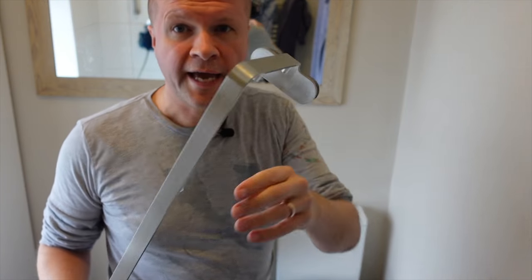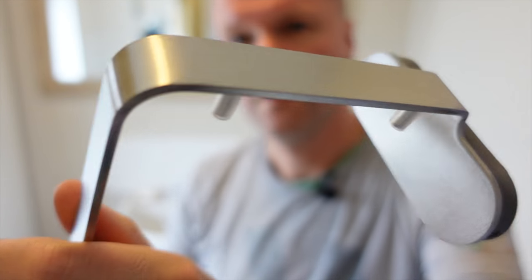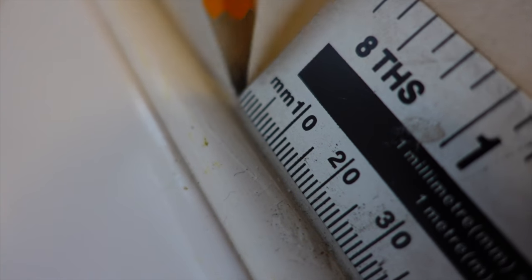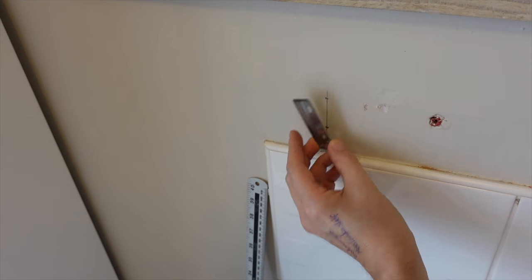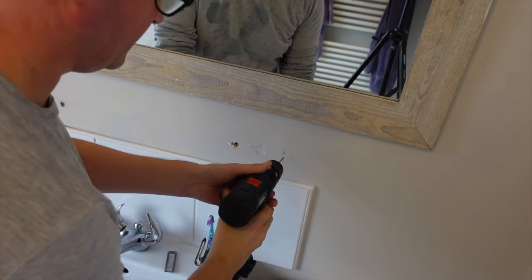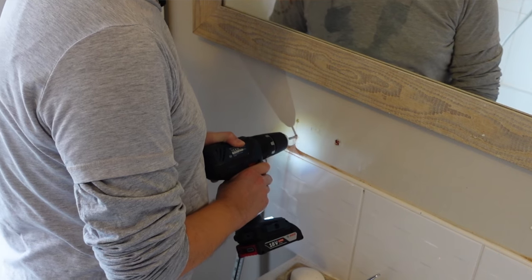Be careful because there is glass in this — it comes wrapped. You get a metal bar thing that holds the glass shelf. I'll show you some of the detail here — look at that! This feels really solid, much better obviously than my $5 picture shelf. So if I measure and find the midpoint... half of 77? It's 38.5. I'm going to need to hold these up because if I made them flush with the tile it wouldn't allow for space between the plate and the edge of the cabinet shelf holder. Drill a hole there and a hole there.